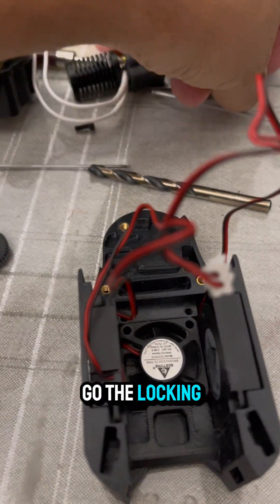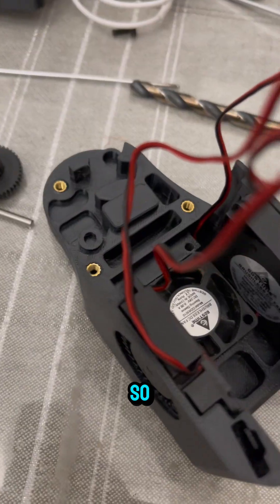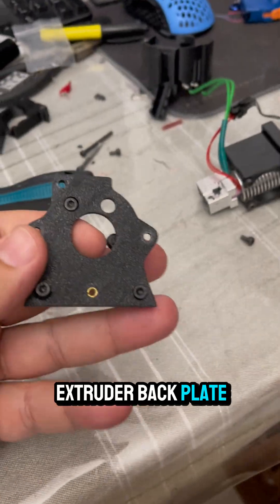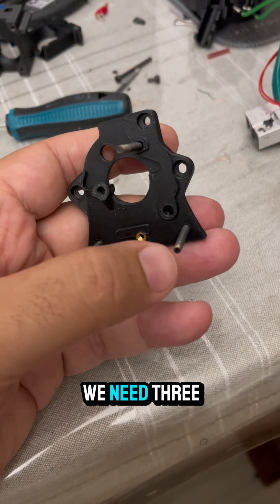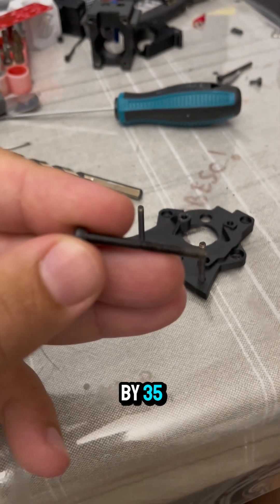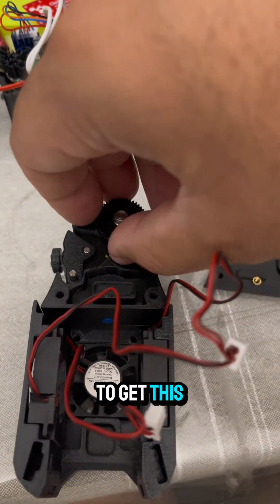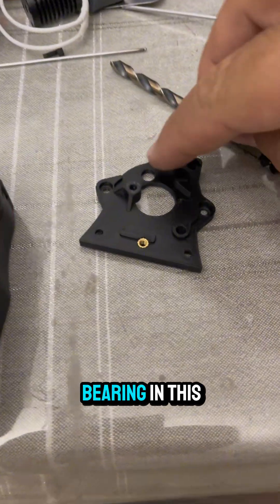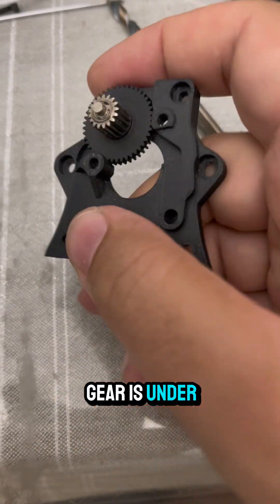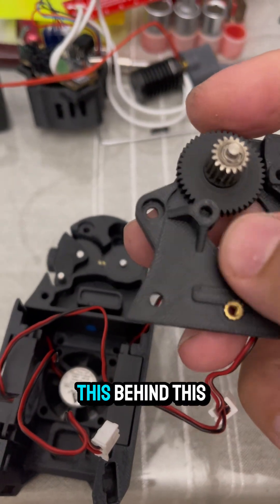The locking pin for the idler door goes in this hole, and the screw for the shutter goes here. This is the extruder back plate — it has a 4mm heat set insert. We need three long screws: two M2x25 and one M2x35. When mounting the back plate, get the gear out and be careful with the bearing in the hole — it's easier to mount them together rather than putting the back plate behind separately.